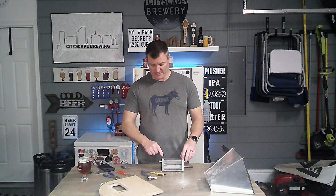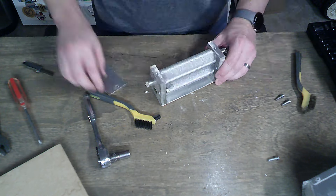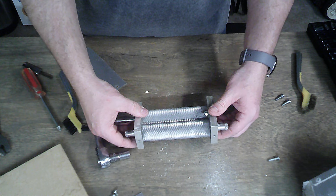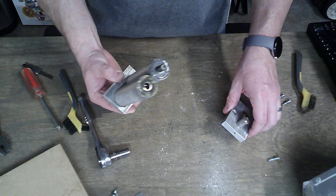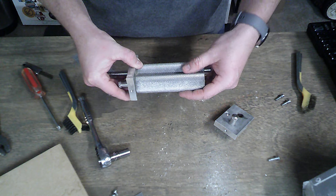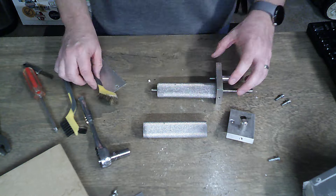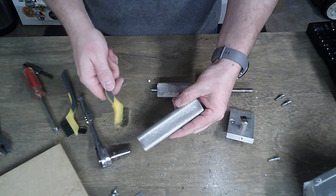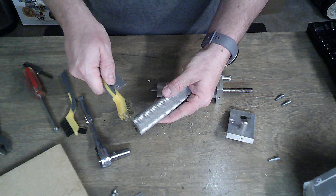Then we're going to take off the side plates to get at the sides of the rollers. When you get to this point with the sides off, you're actually able to just pull these completely off so you can clean them better and make sure you get all the junk that's slowing those rollers down out. Once you're done cleaning up the sides, make sure you get the rollers themselves — all those little grooves will hold stuff and keep the rollers from gripping the grain.